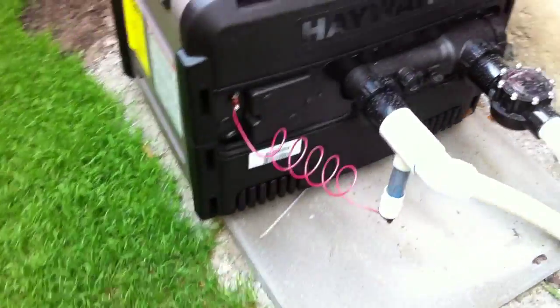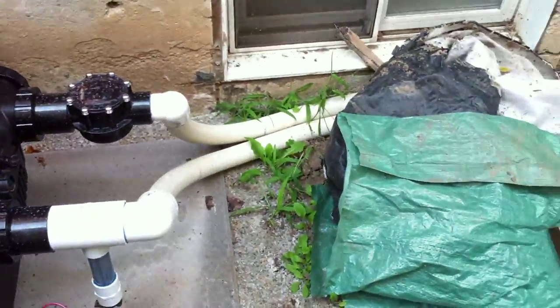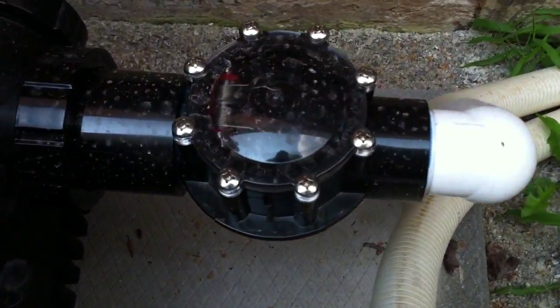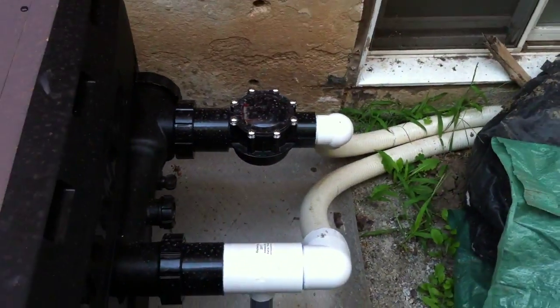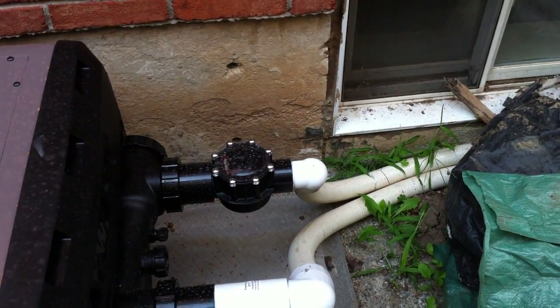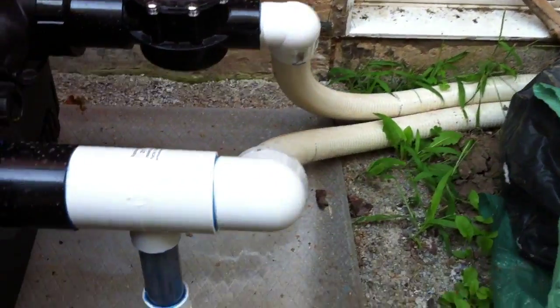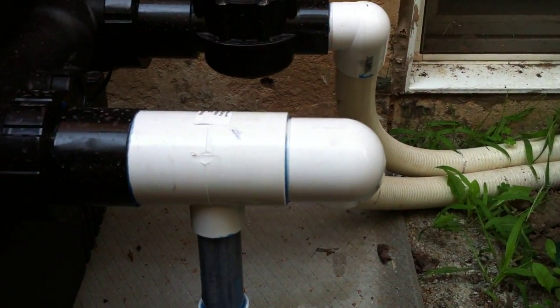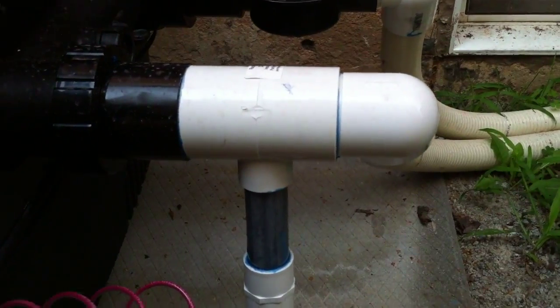We're running out to a new heater here, replacing the old one that has failed. This new heater has some very specific benefits. Number one, it's got a check valve to prevent water from the salt water chlorinator from tracking backwards. What is also super interesting here is that a sacrificial anode has been added to help mitigate the damaging effects of galvanic corrosion in the pool.